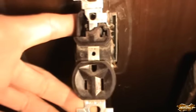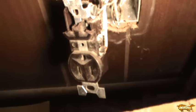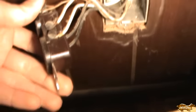What I highly suspect is that one of these Romex lines right here is coming from the breaker box, or at least a junction box in the attic, and then this goes out to basically all the other outlets on the circuit. This is the first outlet on the chain of outlets. It comes in here from probably a junction box because the lights in this room are also on the same breaker — basically into this outlet, out to the two outlets in the bathroom, and four outlets here in the bedroom. Oh yeah, and I regularly plug a space heater into one of those outlets too. That's not a good situation.